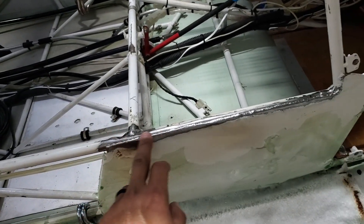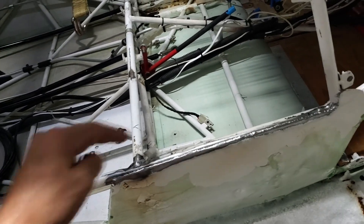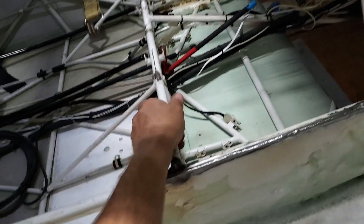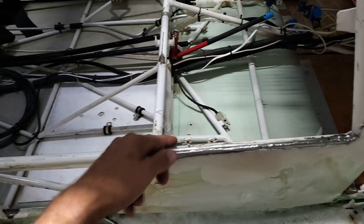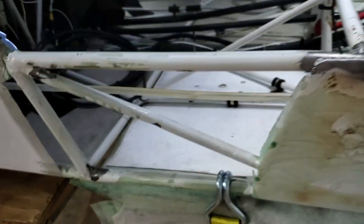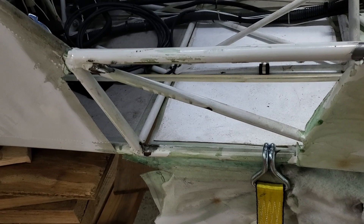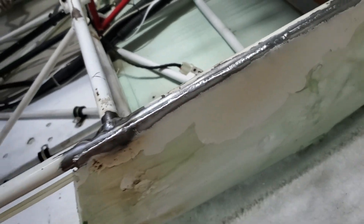So I just want to show you what I'm about to do in the next couple of days. In order to fix it, we're going to cut this reinforcement plate off along this seam here, cut out this portion of tubing, and replace it. Once we've cut this out and this off, it should spring back to where it's supposed to be. If it doesn't, we can just bend it back because the bottom truss down here isn't bent — it only bent the top one. So hoping once I get that cut off, it'll spring back. Then I'll put in a new tube here. This tube is bent but should be able to bend back; if it doesn't, I've got replacement tubing. And of course I have to replace this longeron too. So far I've gotten the paint stripped off of here, just got a little bit more to strip to make sure it's good to go for welding tomorrow. Without further ado, we're going to continue on stripping off the paint.